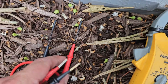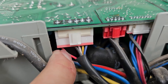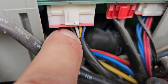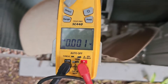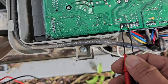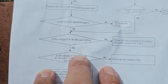I'm going to switch out my test leads and put the little skinny test leads on there. The red wire, which is all the way over to the left, is terminal 1. So we're going to check from terminal 1 to terminal 3, which should be the black wire — you should measure over 250 volts DC. Take your meter, put it on volts DC, then take your test leads and gently place them on 1 and 3. We're reading 338 volts DC.